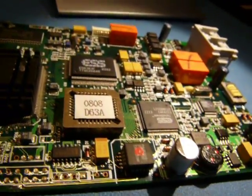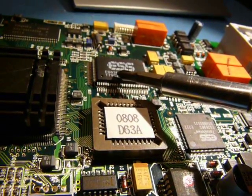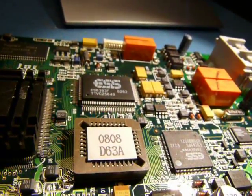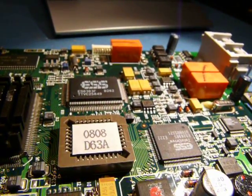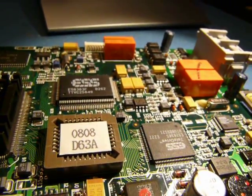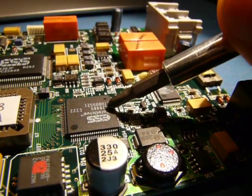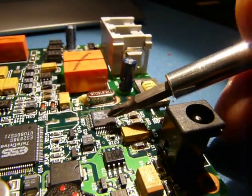Moving along. Over here we've got an ES8383F, again by ESS, and I'm not really sure what that is. I was poking around, and the closest thing I could find was an ES8381, which was a DVD video processor. So I'm pretty sure that's just the video processing chip, maybe a built-in codec. Oh, I should point out the Teledrive: the master was an ES2898S, and the front end was an ES2828S.